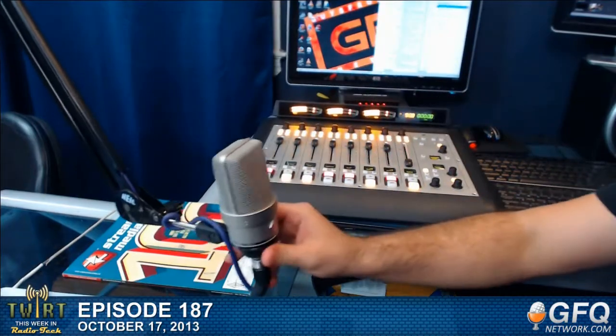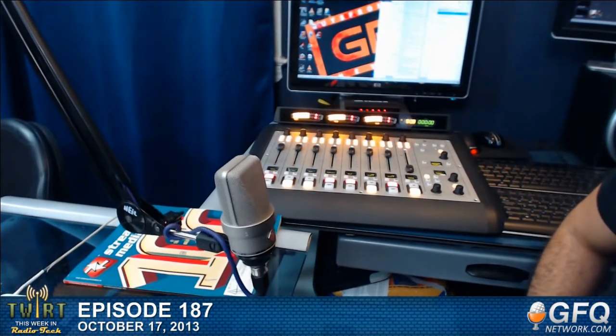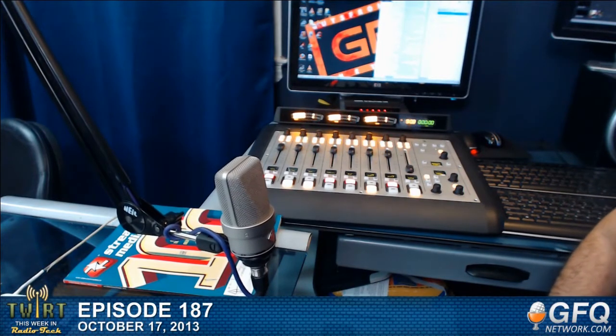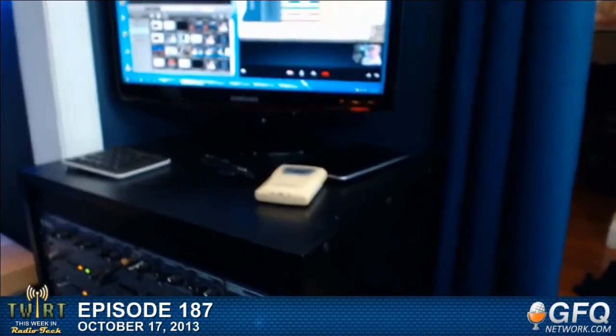You can hook it up to another Ethernet switch if you need to, to hook several rooms together. The engine has local audio I/O, so it's got analog inputs, analog outputs. It has a couple of AES digital inputs and outputs. It has four microphone level inputs as well, and then it also has the Ethernet switch built in, so you can tie it to other Ethernet devices. Things like in Andrew's studio, he can feed the Omnia 1 audio processor over Ethernet. It becomes a Livewire source and destination. Doesn't have to run other cables to it.